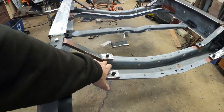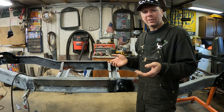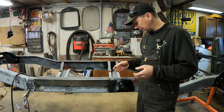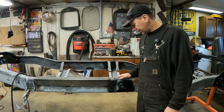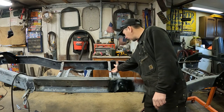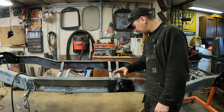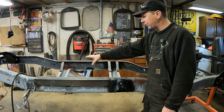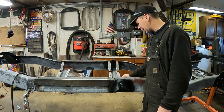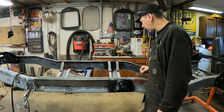The springs are loaded on the outside of the frame and they would tweak it real bad, so that's why these are here. This is beefier than it was originally. I got the cross member bolted back in, these are bolted on. I'm actually going to take the welder and weld these on the inside. I've been having nothing but problems with this GoPro camera — I don't know if it's because it gets cold, but it says low battery when the battery's got 60% and it died on me three times. So I got you plugged into the wall. Anyway, I'm going to take the welder and weld these back braces to the edge of this cross member. They'll still be able to unbolt from the frame here. I want to rely on more than just the bolt to hold it back here because of the twisting force — the bolts are 3/8ths Grade 8, but I just want to help stiffen it up.